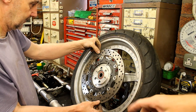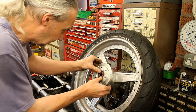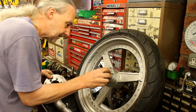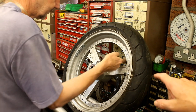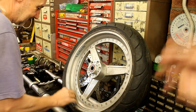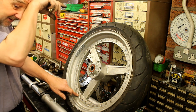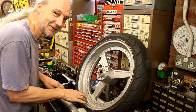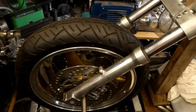The original carrier on there was made for whatever discs I had at the time - I think it was some Suzuki GSXR 1000 K5. We've got to remake that. The bearing is at the end of that hub. The other thing of course is for this wheel - the rims came off an old Astrolite and they were all painted gold and black. We've blasted it to get the paint off so those rims need a good polish. The rear is polished but these aren't - we'll put it on the horizontal miller and use various grades of wet and dry.